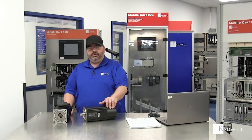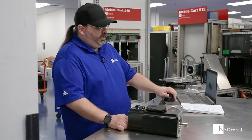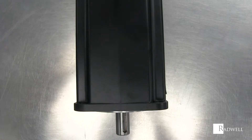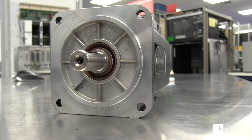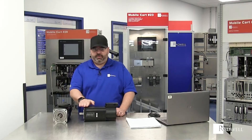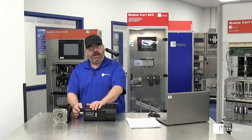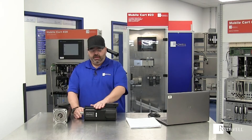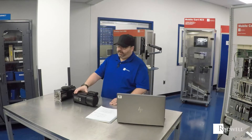They were really unique when they first came out. One of the things that makes them unique is their incredibly robust feedback systems. They have a one-piece casting design where it integrates the front housing and the main housing all into one piece. That's going to eliminate two separate pieces, but it's also going to allow you to have an incredible amount of robustness and concentricity of the rotor shaft all in one piece. But there are some drawbacks that we'll talk about later.